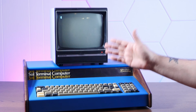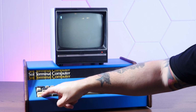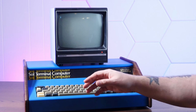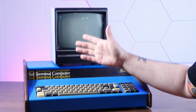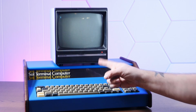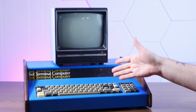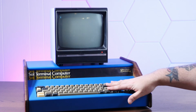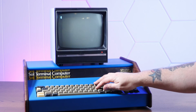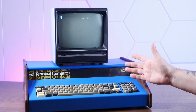Yeah, these keys do nothing. No input on the display. There is a light lit up on the local key, which I don't totally understand what that means yet. But pressing the uppercase key and shift lock key, yeah, that's right. This thing does uppercase and lowercase. Take that, Apple II. Hopefully, this is just because this keyboard is foam and foil, and the specific foam that they used in these key switches is notorious for breaking down.